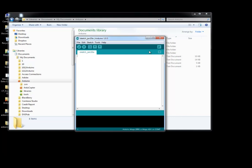If you don't do that, you run the risk of having the current arc from your USB cable to the board and shorting something out. I've actually had that happen a couple times now, and it took me a while to figure out why that was happening. So yeah, USB cable into the flight controller first, then into the computer. So plug that in.